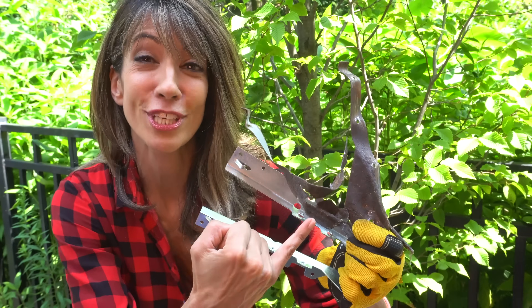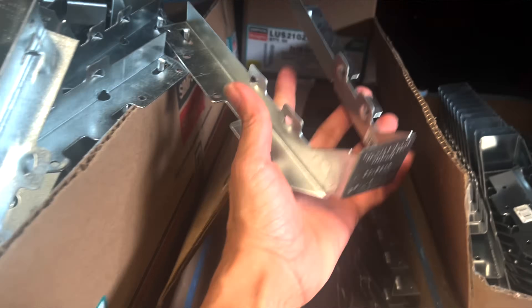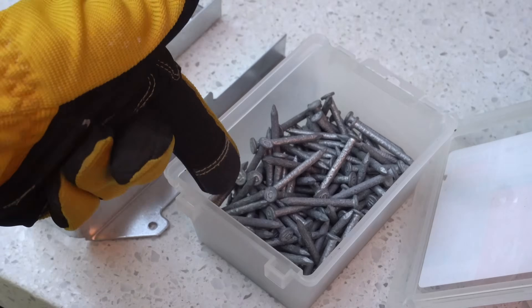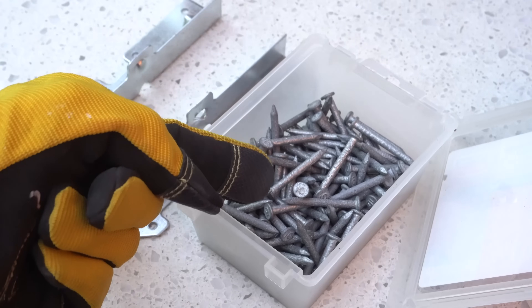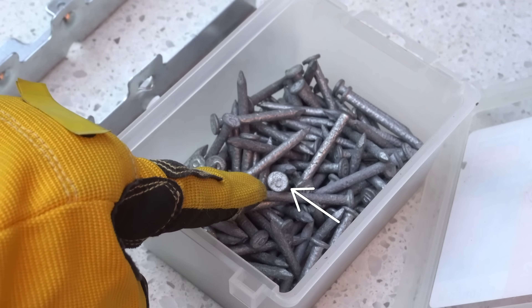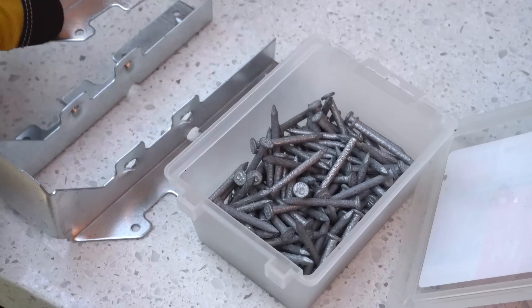Now to prevent your joist hanger from looking like this, there is a lesson to be learned about fasteners — they have to be rated. A rated fastener is an approved fastener; you're allowed to use it and the rules are strict. You can only use approved nails or screws. When you buy your fasteners, check the box for the size. These right here are your approved fasteners for your joist hangers, and you can tell the sizing because it's stamped right there on the head of the nail — it says 10. So we're not using these today; we'll be using nine.